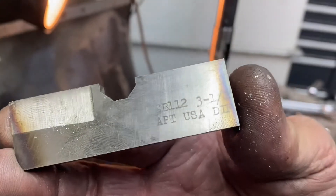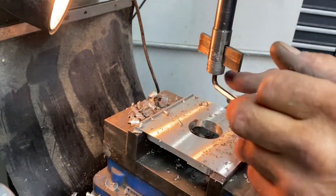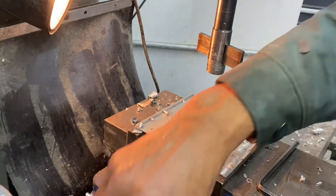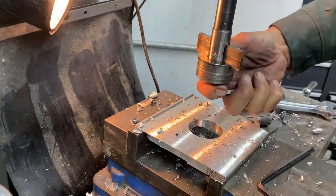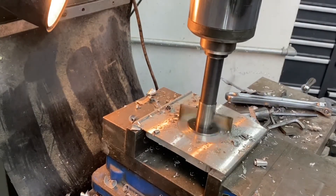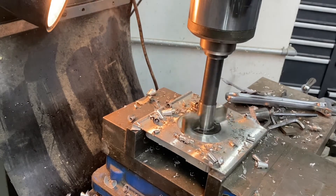There's the bigger one we're going to use for the three-and-a-half. It's just a series of steps, and these blade drills can go up to really big diameters - six inches and bigger. Tighten it up, drop on the two-inch pilot, and the set screw goes deep enough so this flat head screw has some threads to tighten that up. Now we're ready to go with the three-and-a-half. I'm just going to lower the blade down onto the part, lock the head down tight, and now start raising the table up so I have a little more control over the feed of the cut.